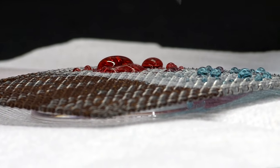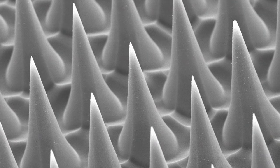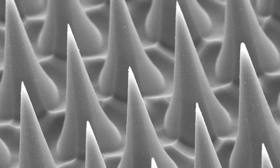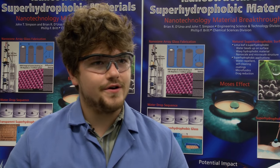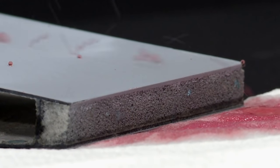Scientists from ORNL developed a glass drawing process which did a differential etch to create very sharp glass peaks. These glass peaks can be varied in size and spacing, replicating the effect of the lotus leaf. We can fit about a million spikes in a square centimeter on a little tiny wafer. This glass was then coated with Teflon or a Teflon-like material. The coating repels the water and the spikes push it up, therefore repelling the water completely. It's really the combination of the chemistry with the geometry of the surface that creates the super hydrophobic property.